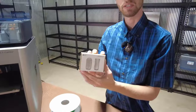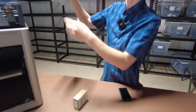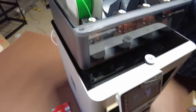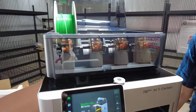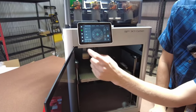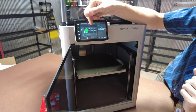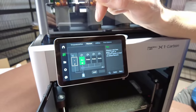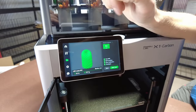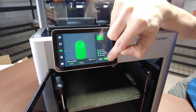We're going to print the little LED kit that came with it as our sample print. We're taking our green PLA Basic that came with the printer, opened up the AMS — super simple, just poke the filament in and it grabs it on its own and feeds it through. It will scan the code inside the roll and recognize what filament it is. Going to settings, filament, AMS loadout — it recognized green PLA, ready to print. We downloaded our little lamp file — it's PLA — and we're going to enable bed leveling, full calibration, and time lapse, then print.